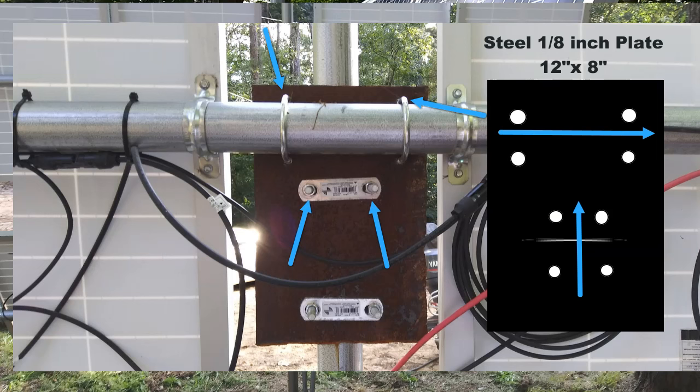That pattern allows the whole section to rotate left and right, and the panels to move up and down. You would think the U-brackets on the panel would be so tight that they wouldn't move, but they're snug — and you saw how easy they were movable. You've got two of these plates on this pole. If you're just using four panels, you could use one crossmember, but this setup handles two, giving you 800 watts. You could build it bigger, or build separate ones in different parts of your yard for different times of day.